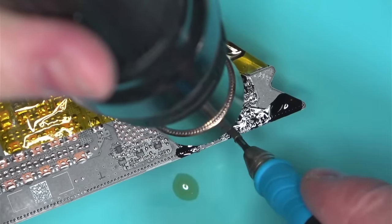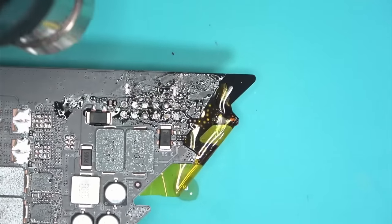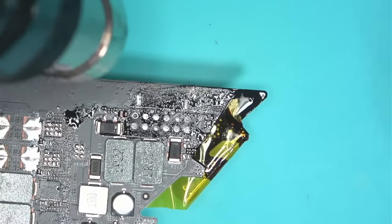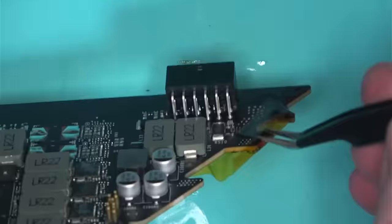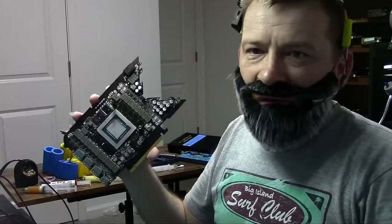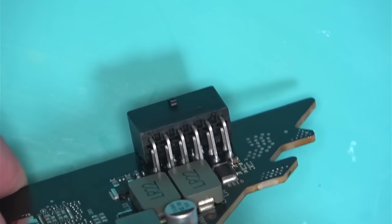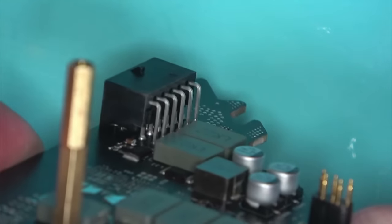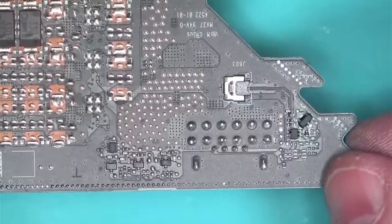Looks like I've got all the pins out. Let me step to the other end of the board — might have to flip it over one more time. Now let's try to suck these holes out using a solder sucker — the northwest sucker, that would be me. And there we have it, the job is done. Let me show you how nice it looks under a microscope — you can see that the solder has flowed all the way through for each pin, and that is exactly what you want to see. That's how you know the solder job was done right. It is now better than factory.